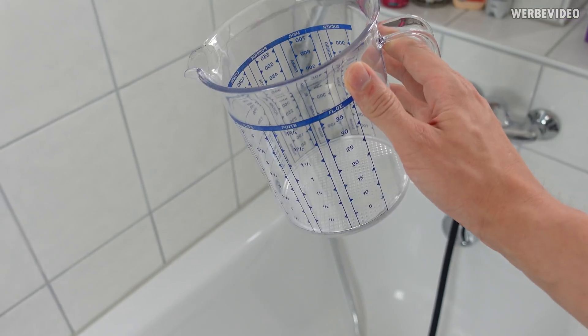Before we use the rest of the tubing to connect the water to our system, there's still the question: how cold is the water out of this tap? If it's too cold we could risk condensation in the system. Right now it's summer — we have about 26–27 degrees Celsius inside — so if the tap water is like 12 degrees it might be too cold. The flow rate will also be interesting.